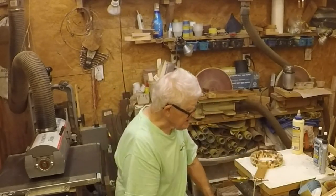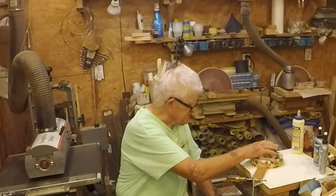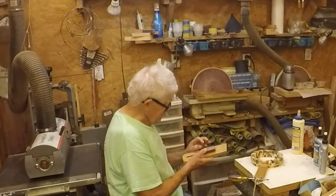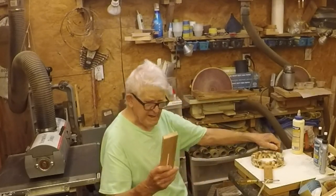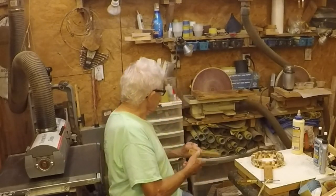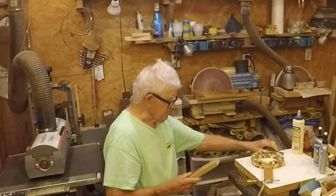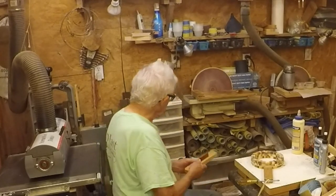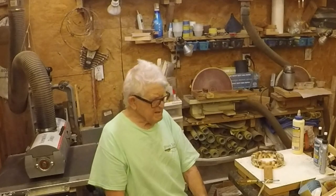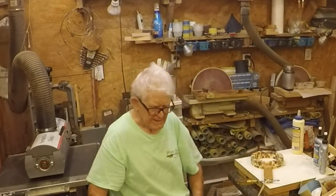That means I've got to cut them less angle. Means I got to change my shim here. On this, I got a shim. I'm going to have to put some more shims on it. I'm going to have to put a shim next to it, sand a couple of pieces, change the angle on a couple, maybe even three pieces, much as it's off. So I'm going to take out a couple of pieces, change the angle on them, and put them back till I get it tight.